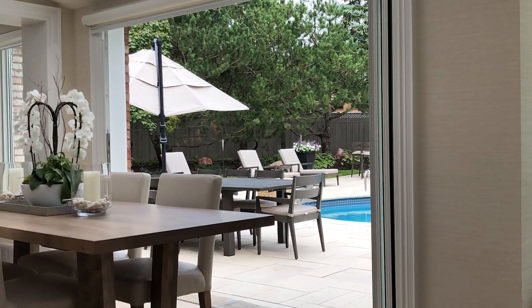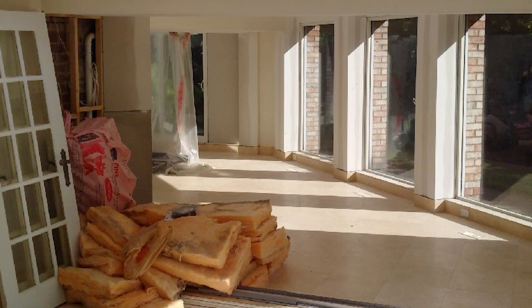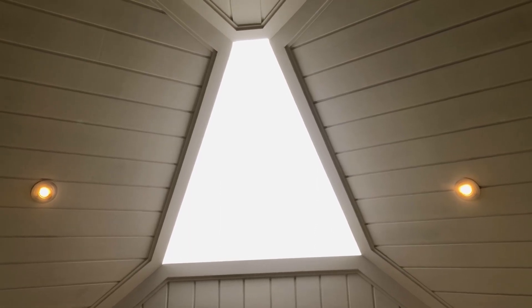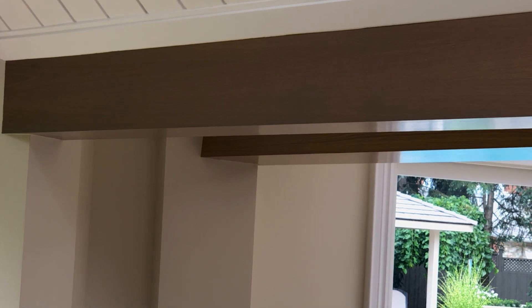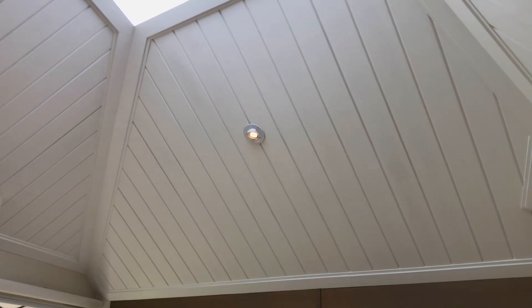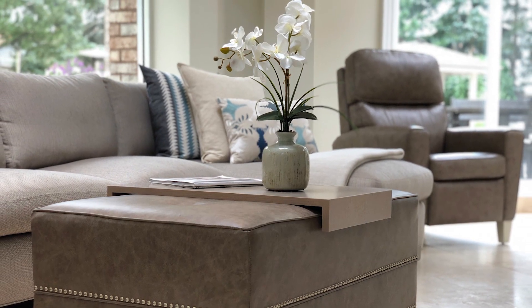Where I'm standing right now is what we call the Florida room or the sunroom. This was here originally, built many years ago, which accounts for some of the really unusual roof details. What we did was bring it back to life and give it more of that outdoor-indoor feel. Part of the way of doing that is wrapping some of the structure in what look like beams — large heavy oak beams that are actually just covers over the structure. This raised area was already here; we took it from plain drywall that was cracking and peeling and added what looks like board and batten. This is actually made from a plaster material over styrofoam, specially cut to fit the odd angles. The beauty of the styrofoam is it moves with the house during expansion and contraction, so it won't crack.